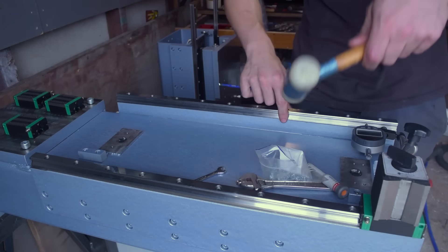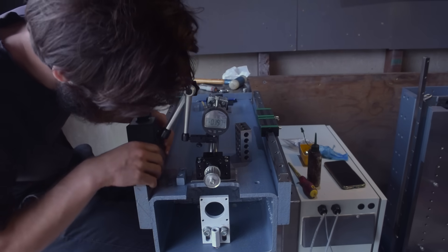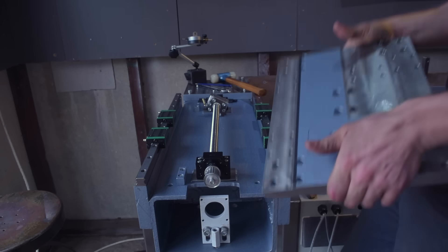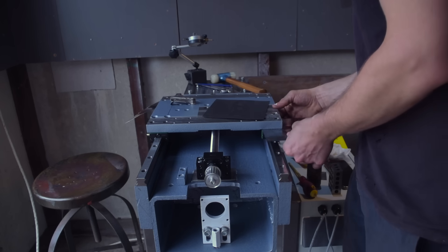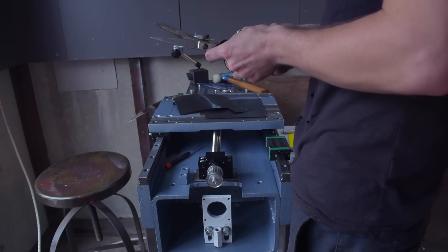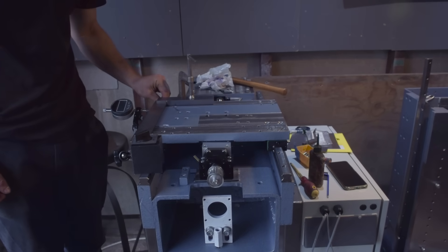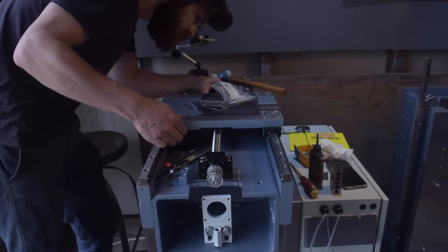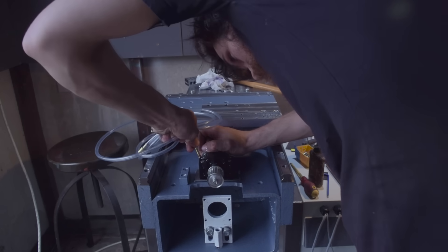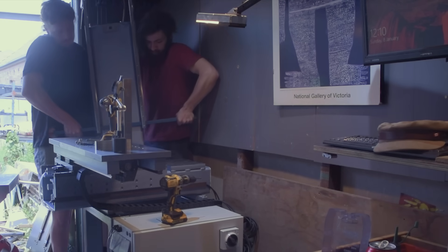Next was the Y-axis. After aligning the rails, I moved on to the ball screw, shimming the mounting blocks to get the screw absolutely parallel to the linear guides. The XY plate also got a couple of shims, and I made sure the bearing reference surfaces on top were square to the Y-axis before bolting it down. I added a brass nipple and a hose to the ball nut so I can grease it without having to pull the machine apart. After going through all that again for the table, I now have a perfect reference plane to align the column.